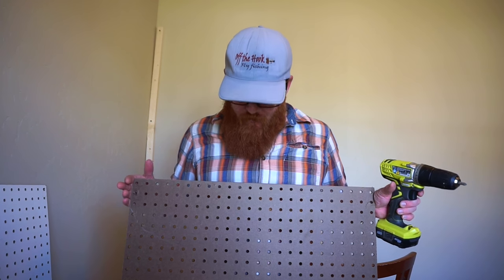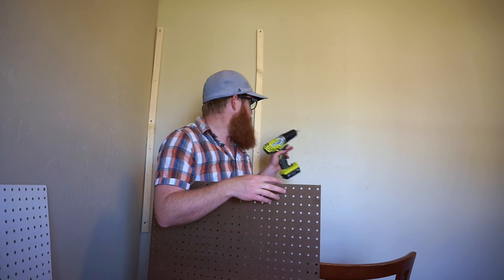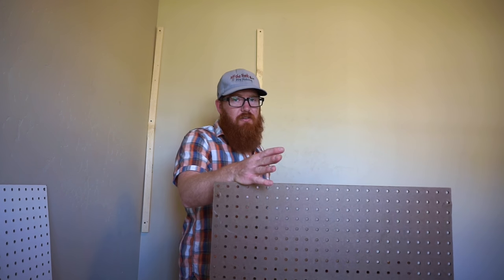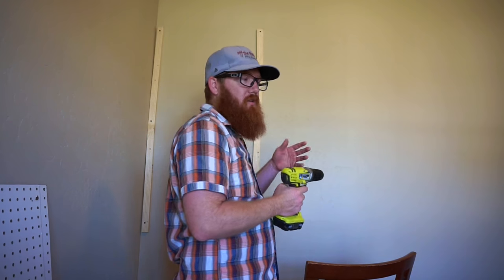Now you might be asking why I'm not trying to find studs. Well, this pegboard is measured differently than how far apart the studs are. If I measured to the studs, the 1x2 spacer bars would go down the center, meaning I'd lose certain sections — probably three rows in a row where you can't put materials. So I just stick the 1x2 right on the edge, losing only one row rather than a whole section down the center. Fly tying material isn't heavy, so you don't have to find studs. The last one never fell, and we've got three screws in each one, so the drywall should hold it fine.